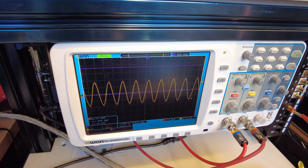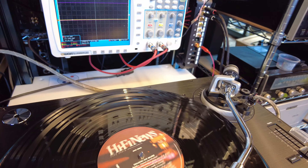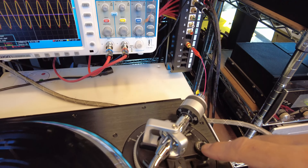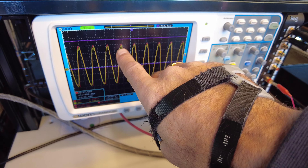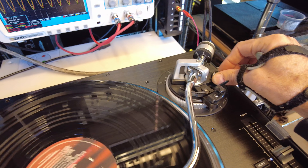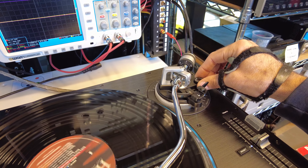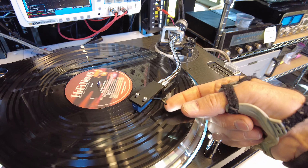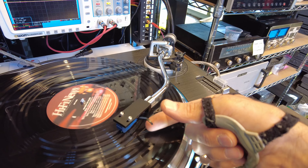On the oscilloscope you can see the evenness between the left and right channels. As I increase and go to the next track, you'll start to see some distortion on one of the channels. Track number two is still tracking pretty well — anti-skate is set at two. On the third track, you'll finally see some pretty heavy distortion on one channel. The anti-skate has an effect on that distortion — you can see it clean up the top of the wave. This is how I make an assessment of how much anti-skate to dial in. This turntable needs about a setting of two for the right compromise level.